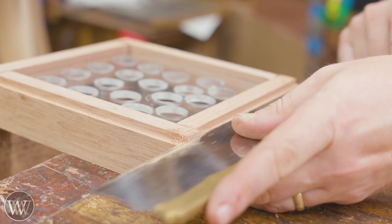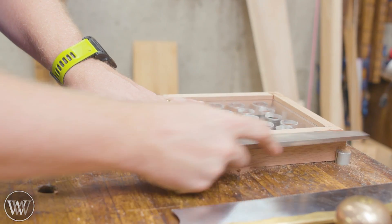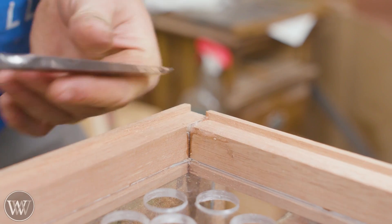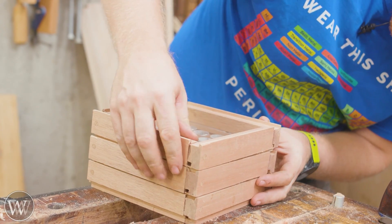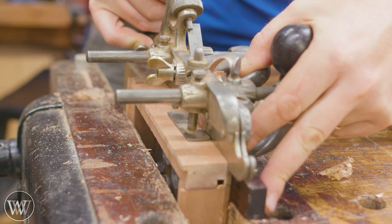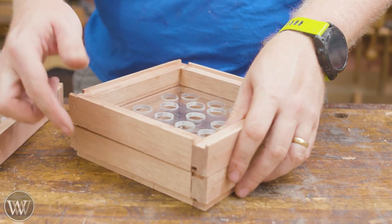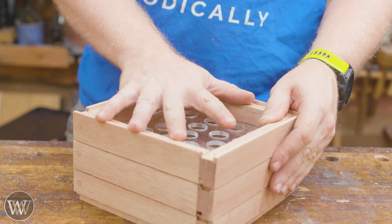And I've got a little chunk that comes out and we have a rabbet that runs all the way around the outside. This rabbet can fit into the other one — you can clean it up with a little bit of file and it's really quite smooth. Use a chisel and a plane to smooth out all the edges. This is more or less a prototype, so we're okay with some problems. I found that the rabbet on the bottom needed to be a little bit deeper so it would fit in there the way I wanted, and I ended up taking one shaving off each rabbet so they slid down nicely.